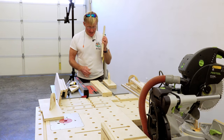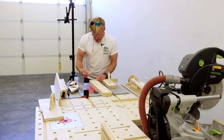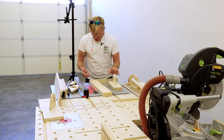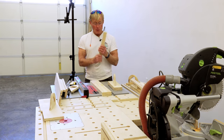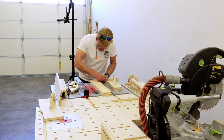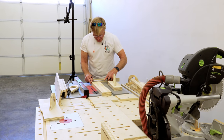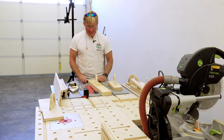Next I'm going to make the heel to go on the back of the push block. This one is going to be — just like the other one — about a quarter of an inch taller than the material is thick. I've already ripped the material for this; it's the exact same thickness so I don't have to rip it again. I'll just make a mark so I know how long to cut it. It's 3 and 7/8ths wide. I've already made the handles, so now I have all the pieces I need and just need to assemble.